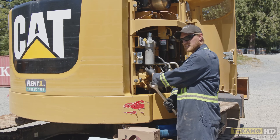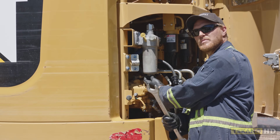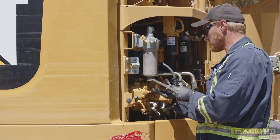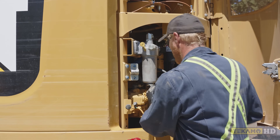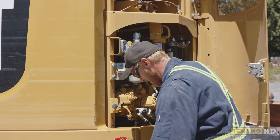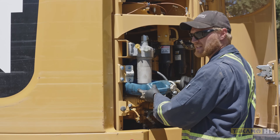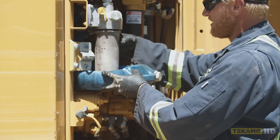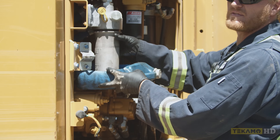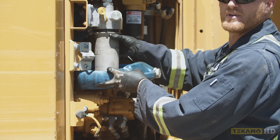There's a piece on the bottom of the filter housing that we can put a wrench on. If a wrench doesn't do it, we can use a socket and a bigger ratchet. One small hit by hand and the filter came loose. Now take your drain pan and get it underneath the filter to catch any oil that's going to come out. Be careful — as the oil filter starts to unscrew it's full of engine oil, it becomes a little off balance and you don't want to let it go.